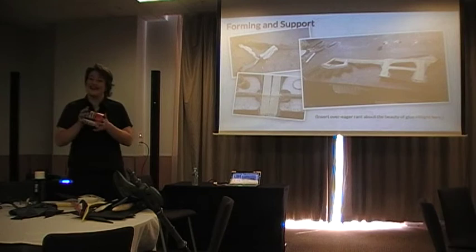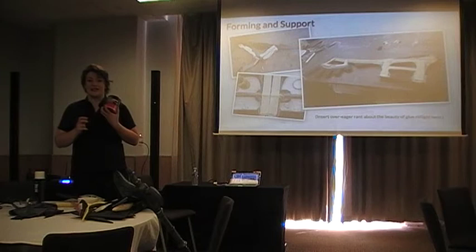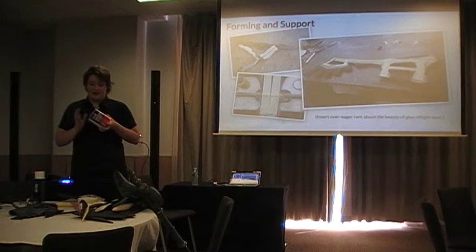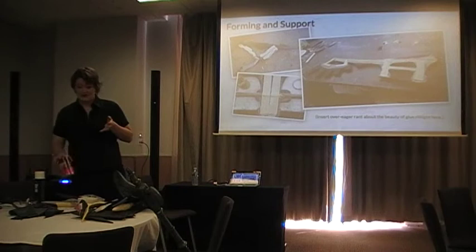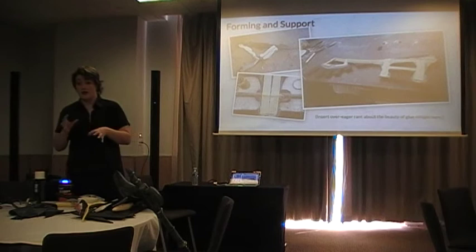is that it's made of a solvent, which is why the thing smells and why it dries. The solvent is the bit that keeps it runny when you're spreading it. It's also made of the actual glue itself, which is usually plastic-based. Believe it or not, contact adhesive is latex-based, so if you come out in a reaction with it, that's probably why. And then there are usually foams and fillers which stop it from going moldy and various other things. So it's usually those three parts. The solvent means that you can basically make a glue thinner or thicker, depending on how you want it to spread.